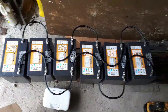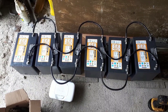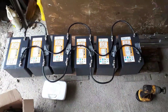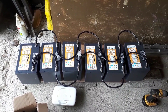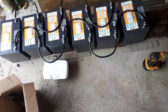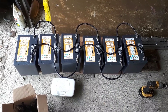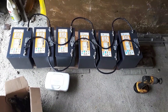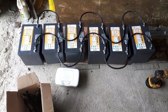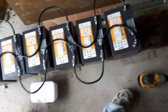So they're hooked up in parallel. Let this sit like this for a day or two, let them all kind of balance — all the power will even out. I'll keep it on a 12-volt charge. Right now that's a 600-amp-hour 12-volt battery, so it might take a while. If I put it into 72 volts, I can hook up a panel to it and it'll probably be a heck of a lot quicker charge. You can see how well they balance.